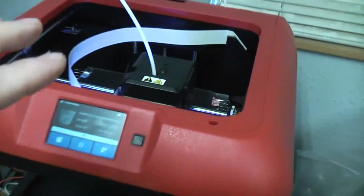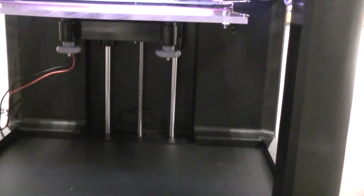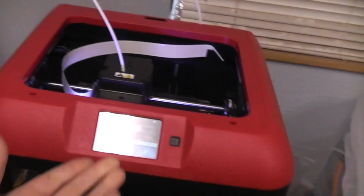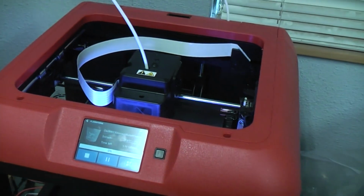The only thing you have to consider, and I guess it isn't particularly hard, is that when this machine homes, it homes the bed all the way down, clearing the back. There's a little switch right here. So it homes in the down position. So you would have to write some startup script for the Flash Forge Finder so that when it starts a print, it goes up X number of steps or millimeters or whatever the script reads. I have no idea, I've never looked at that. But that would be the only tricky thing I can see, so that your print would always start in the right place. You'd have to have some start code that matched the Flash Forge Finder, since it doesn't home up in the print position, it homes down in the done position.